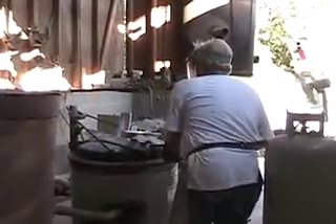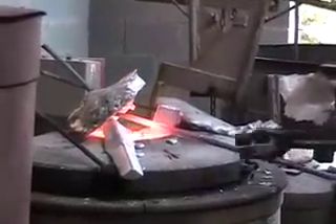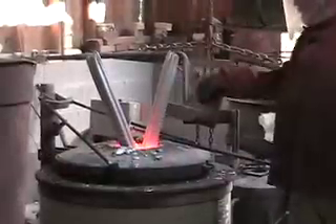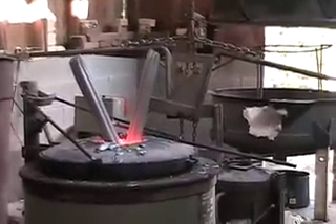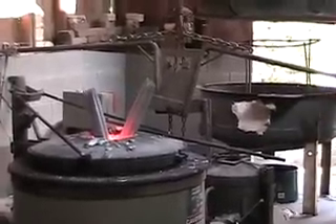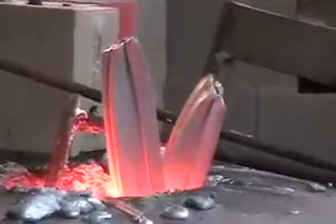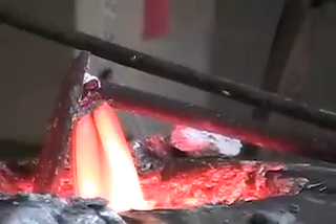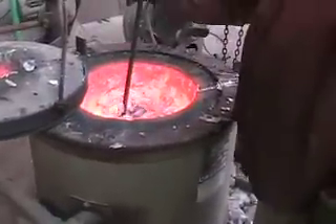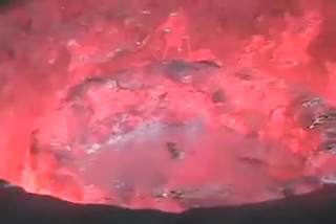After we've started firing up the molds that are in the sand tank, we will fire the furnace — recharge the furnace first with metal into the crucible. Then we fire the furnace, close the lid, and continue to lay pieces of metal on top of the furnace to take out any moisture that might be in the metal. Then we insert those down into the hole on top of the furnace into the crucible. We'll go to about 2100–2200 degrees on the metal, and we want to pour it at about 2100 degrees.